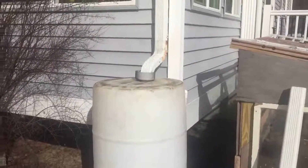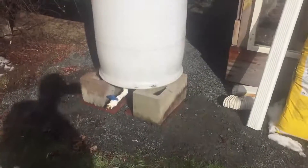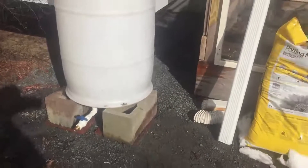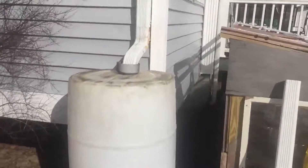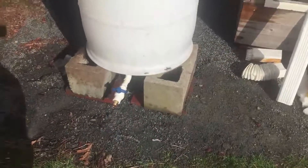I have a filter system made with an ordinary woman's stocking. Down at the bottom we have a spigot at the lowest point so that if there's any sediment that passes the filter — which collects the big stuff — it will be washed out when you first open up the spigot.